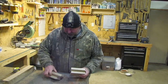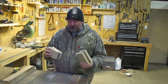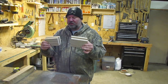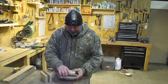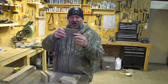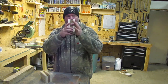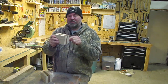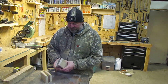I got two of these head blanks cut. On these two I'm going to do hard maple on the outside and walnut on the inside. They're about three and a quarter inches tall by five inches wide with a little bit of an angle, and later on these will all get rounded over. In the center on the bottom I've got a one-inch mark going out to an inch and a half. Basically before I do these glue-ups there will be a mortise and tenon in the center — with a little wedge from one inch to inch and a half — and when the handle goes in we'll score marks where we can pound the wedges in.